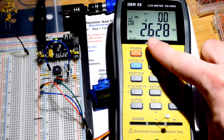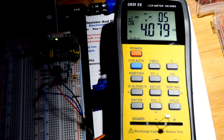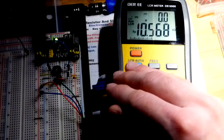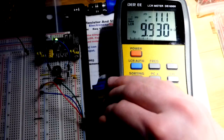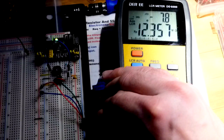That's in kilo-ohms right there — 2,628 ohms. If I turn the light away, the resistance is going up. That's actually how we changed the servo: by changing the resistance of this light-dependent resistor. About 10 kilo-ohms there. If I put my hand there, it would go up to the millions of ohms and keep going up. Now we're at 12 million ohms — 12 mega-ohms.